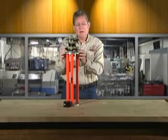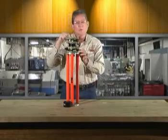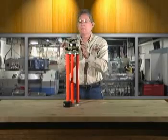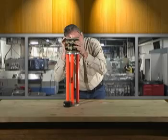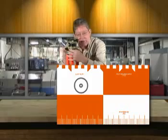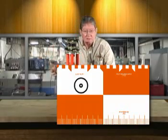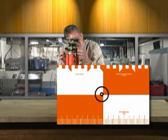Because the bottom Tribrac allows you to tilt and point the one that you're calibrating. So the procedure is, once you get it set up, it rotates really freely around it. Focus on your target. Use your bottom leveling screws to actually tilt, just like you would if you were setting over a ground point in a real situation. Point it exactly on your target.